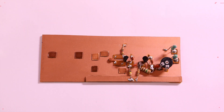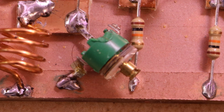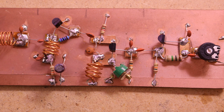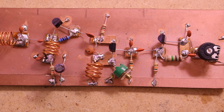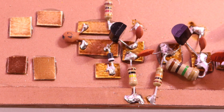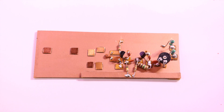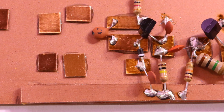Between the two larger pads I soldered a 4.7pF capacitor. At this point I added another pad because I forgot it — it's because of the varicap, and you don't have to do this if you only have a variable capacitor. I made a prototype with a variable capacitor where these two pads are missing and you just use the variable capacitor to adjust the frequency. After that I soldered a BB547B varicap with the marking facing toward the larger pad, and from this pad to the larger pad a 1nF capacitor.